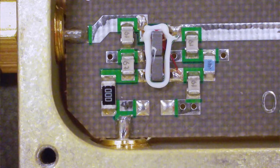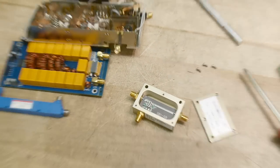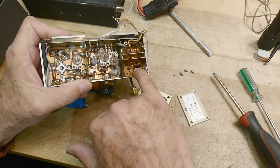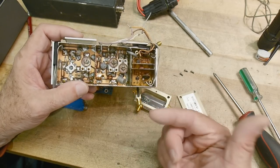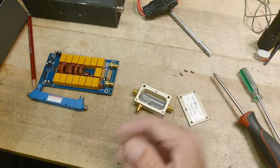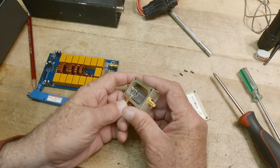There's a little difference between a coupler and a detector. A detector just adds a diode as a way of detecting the signal. For things like this the diodes are built in — there's a little germanium diode right here. The reason you use germanium is because it has a lower forward voltage, so you can measure lower signals. All of these things can either have the detector already added, or be a coupler where the detector is somewhere else — like a spectrum analyzer is the detector — so these are just 50 ohms in, 50 ohms out.